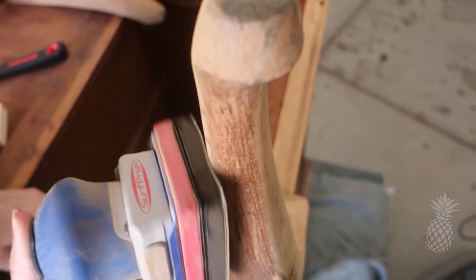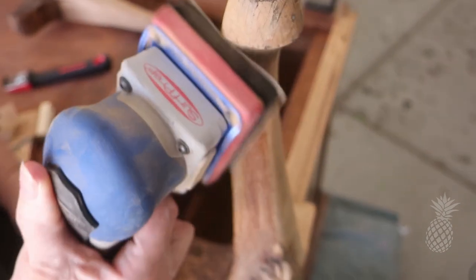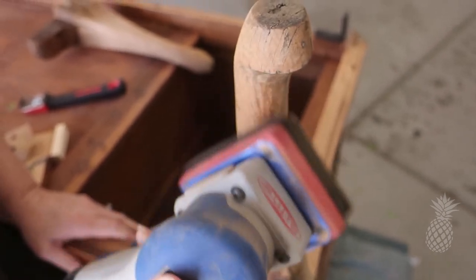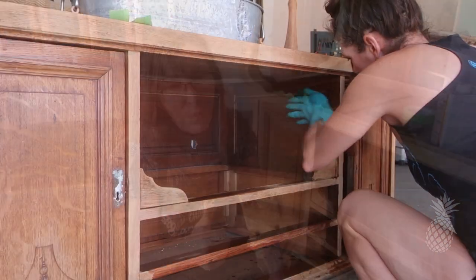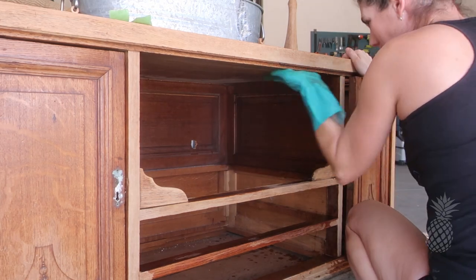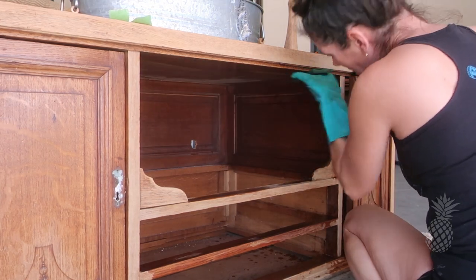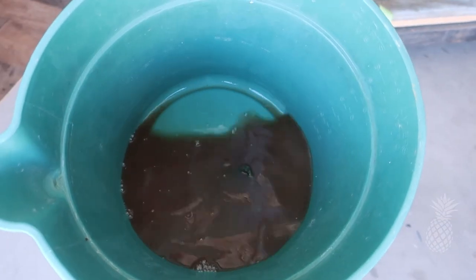Since I used stripper on this piece, I didn't start off by cleaning it, and then I totally forgot to clean. You could tell pretty fast - just look at the gunk on the sandpaper. So we had to stop everything and clean the piece up. People have used so many years of Pledge on here that there's just a buildup of this waxy finish. So let's get that off.